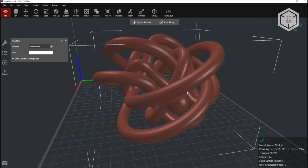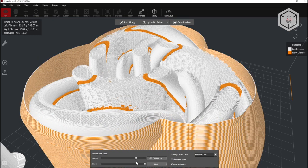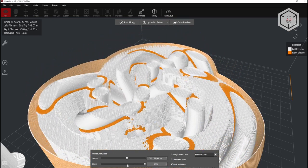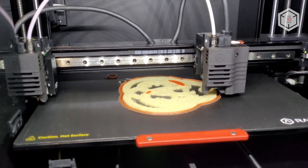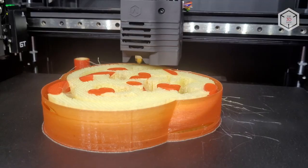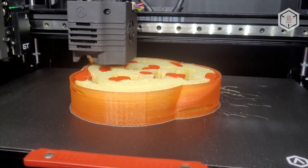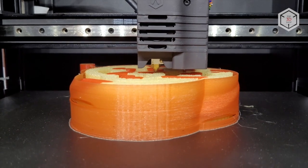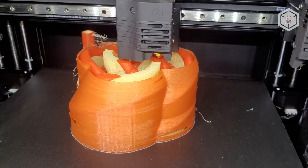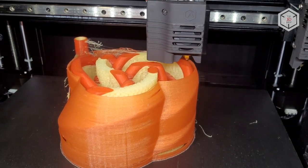Virtually, the most important advantage of a dual extruder is its ability to print supports with soluble filaments. Some complex models with overhanging elements require support structures to prevent deformation while printing. With a single extruder, supports are printed with the same filament as the model, and then removed with the risk of damaging the part. Besides, some models need internal supports, which are impossible to remove after the part has been printed. Using the second extruder for printing supports with a soluble filament solves this problem.